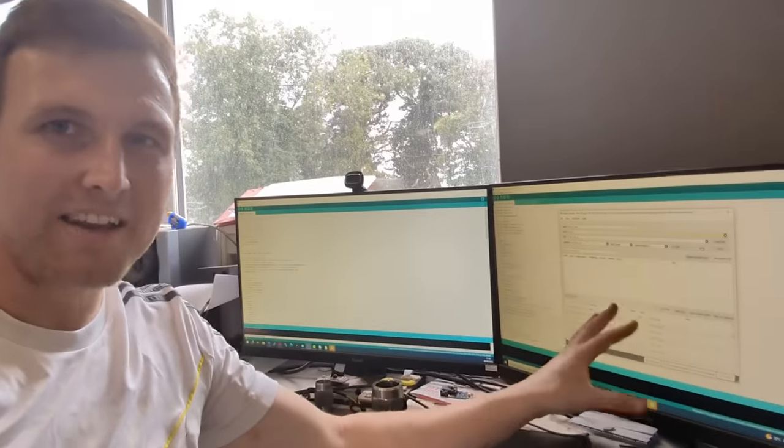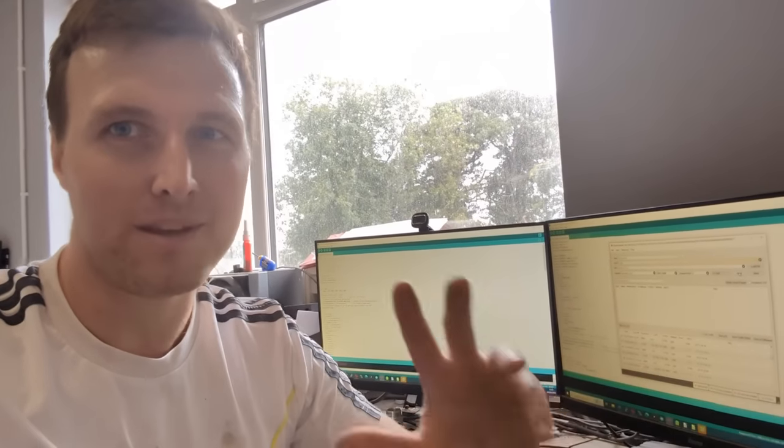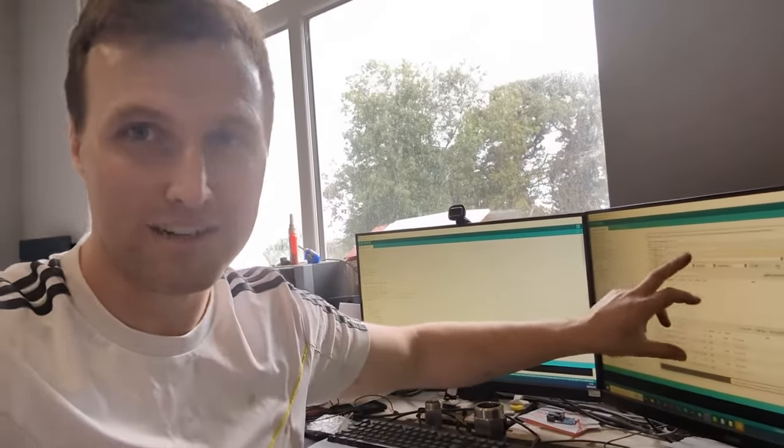So to actually send a command, we use a protocol called UDP. It's just a really simple, non-secured, non-encrypted communication protocol. And we just send a string of 3 values. So in this case, I am sending 220. That is where number 2 is the command, which is for relay control. And then the number 2 in the second position, I'm terrible at explaining this, is for which relay we want to control. So we have 2 relays, so we want to control the second one. And then the 3rd digit in the string of 3 is the state, so on or off.